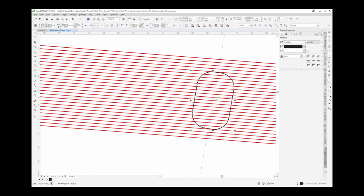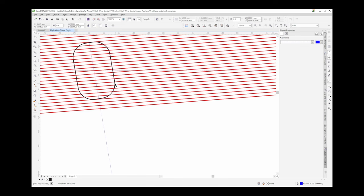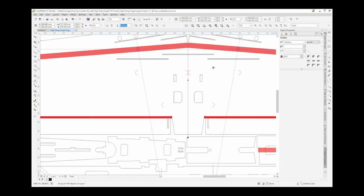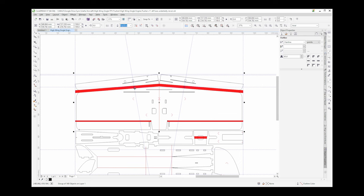And just for fun, we can check to see if that's aligned on the other side with a rail that'll pass all the way through. Click this. Oh, lo and behold, we got lucky. Amazing. So there we go. Now we have what should offset that hard point by about 3.5 millimeters inboard to allow the Nerf darts to be aligned with the free stream of the aircraft in forward flight.